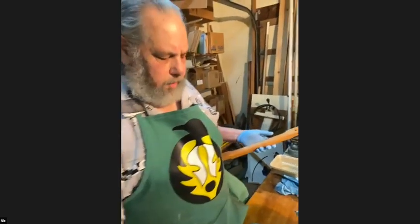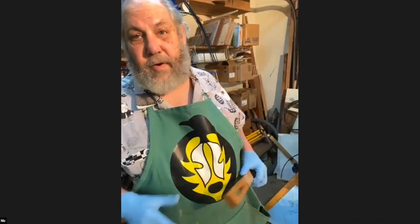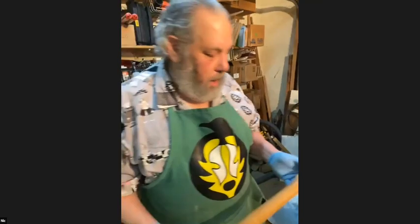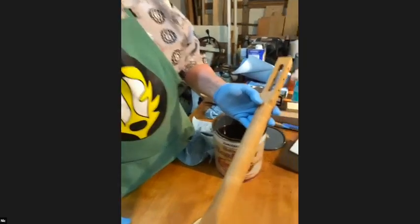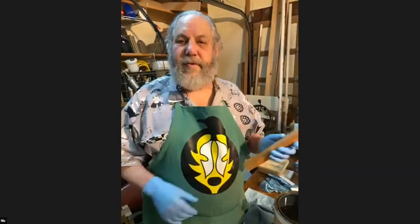I'll show you the same technique for all the different finishes today. Note: this technique does not work with water-based finishes — it only works with solvent-based finishes. With shellac, remember alcohol is a polar solvent, so when it dries it may fur up. Before continuing I might de-fur it with ultra-fine paper — 500 or 600 grit — or gray Scotch-Brite to just take the fur off.